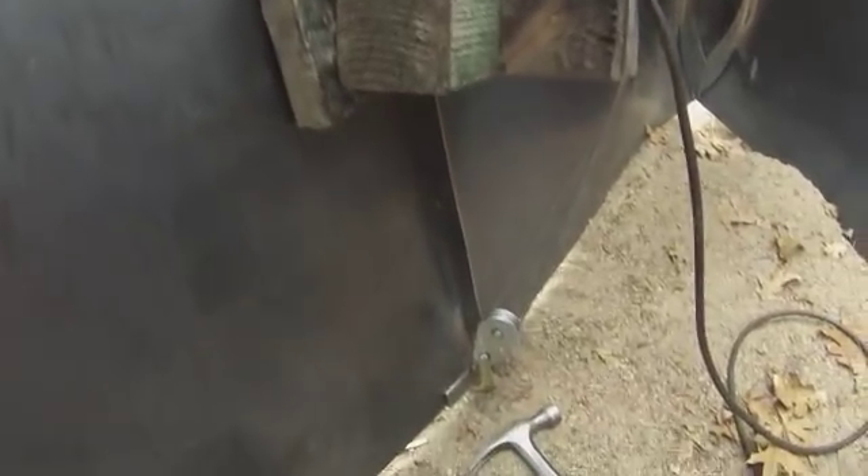No result. Let's try something else. What I've done to reduce the gap significantly is weld a little bit — that creates some heat which allows the metal to bend more easily — and then I crank on a little more pressure, and then use the hammer. I make sure to keep everything lined up with this black line, which will be the straight up-and-down reference.